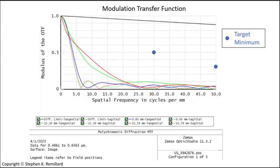The whole point of a telephoto lens is to clearly resolve a faraway object, giving some importance to the modulation transfer function. I've seen it stated that a good MTF target for a 35 mm film camera is 30% at 50 line pairs per millimeter. You might know some other target, but I'm going to see if this embodiment can be nudged into that performance.